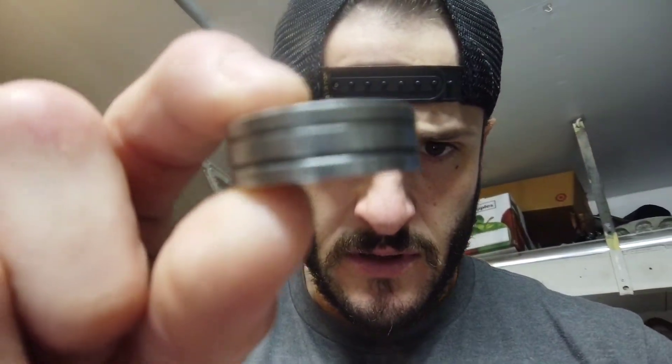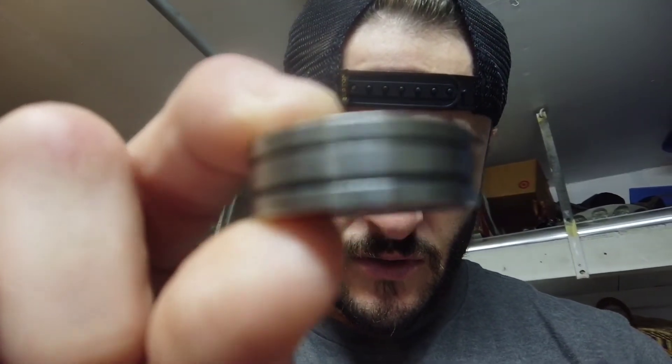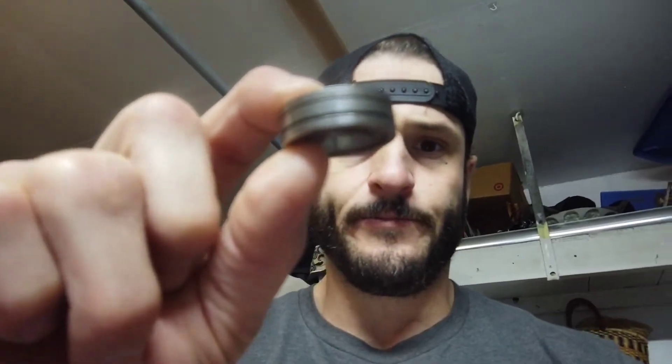So the main issue when I was running flux core — you have your standard drive roll, and it basically has a smooth groove, it's a V-groove in there. This one does .025 on one side and .035 on the other side. Most people may know about these types of rollers, but this is a different roller.